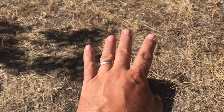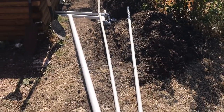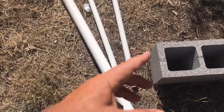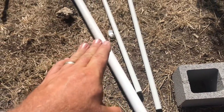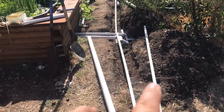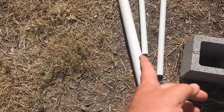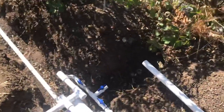There's going to be a two inch and a one inch going this way. If we didn't run those double one-inch pipes — it's only a little extra pipe and a couple fittings — we'd have to cross here where we can only dig about two and a half inches deep and barely cover the two inch pipe. By running the double one inch we made it so when we come down here we can tee the two-inch with a 90 and the one-inch with a 90 on the other side, and we're good.